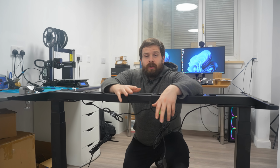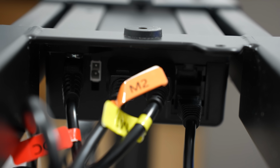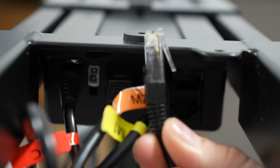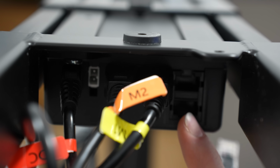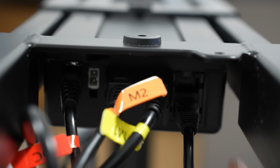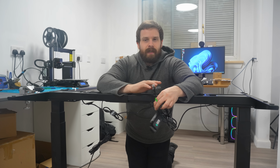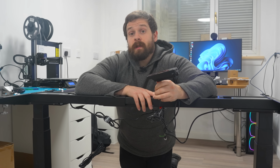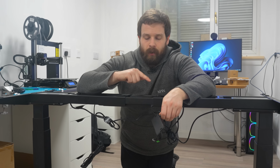But one thing that's really nice about these FlexiSpot desks is that the controllers in the middle have a secondary RJ45 port, which is for an additional controller. So in this case, we can just wire up an ESP32 to that second port that's on the controller, leave the physical buttons intact, and then you don't have to actually cut up your original cable and void the warranty or anything like that. But we do still need to figure out how and also what we are going to use to speak to the motor in the middle through our ESP.